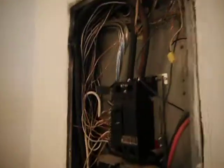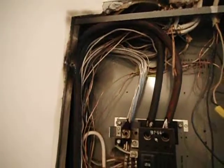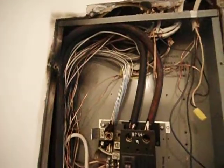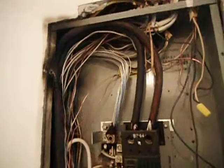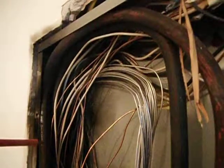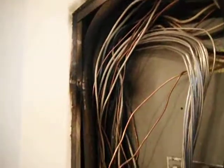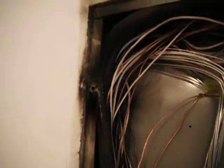Hello, this is Patrick Waddell from Home Inspection Carolina, and it's days like these that you're glad you use proper equipment when you're removing electrical panels. When I took this panel cover off, the whole panel arced, as you can see by the flashes here. This has happened before because from here to here it has a massive amount of electrical tape on it, so when I started turning the screw it arced against the box again.